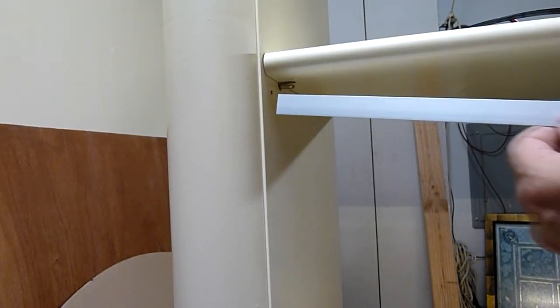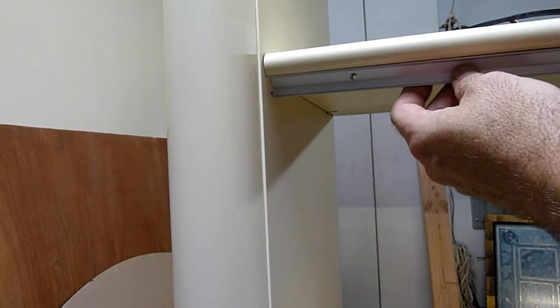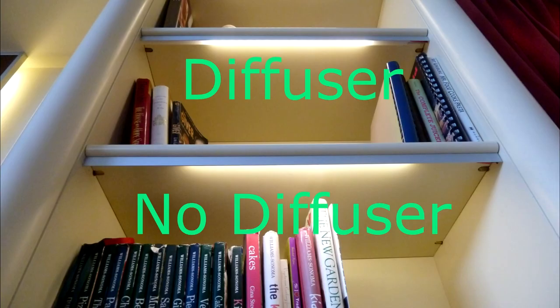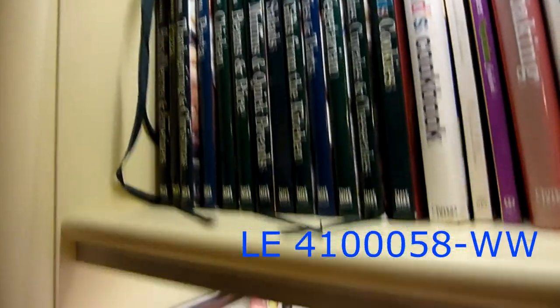This is important because I selected LED lights for the front. To put the LED lights on, I decided on 45-degree aluminum without the diffuser. The diffuser actually brings the light down below the aluminum, making it more visible from the front when you're looking at it. Normally, this type of LED lighting track is mounted with brackets or double-sided tape, but I wanted to minimize the ability to see how the brackets were mounted and create a nice, clean finish.